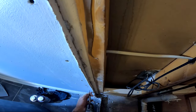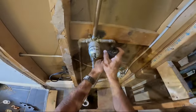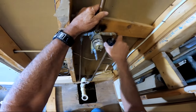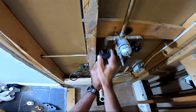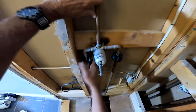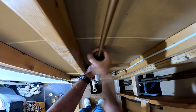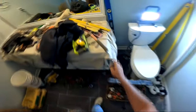I can't center my drain and do my plumbing work without having built the curb first, so I'm moving on to the plumbing next — cutting out the old valve. My customer on this job wanted to learn how to sweat pipe. I'm one of the guys who still sweats copper and hasn't moved over to PEX. This pipe cutter — I think it's a Husky brand — you just keep turning and turning and it clamps on until the pipe is fully cut, much better than the old twist-bottom style.